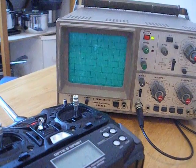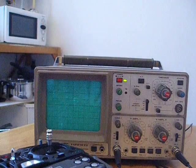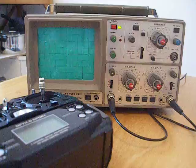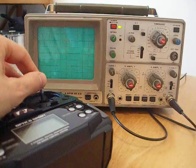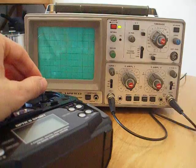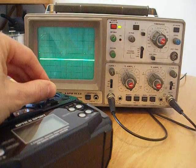Now, the waveforms. This is relevant to one motor only, as the other one is absolutely the same — there's nothing different. This is the radio receiver output. You see, this is the pulse — this is what is called pulse position modulation. This is absolutely unsuitable to drive directly a motor or a half-bridge driver. Instead, pulse-width modulation must be used to do this, and this is what the microcontroller does.